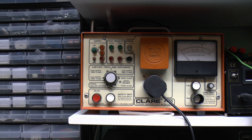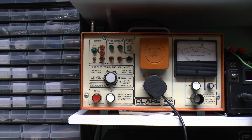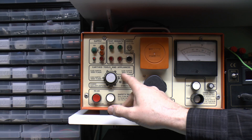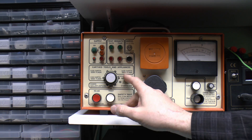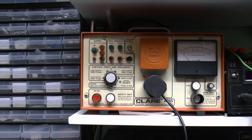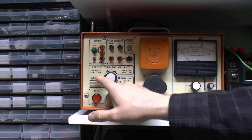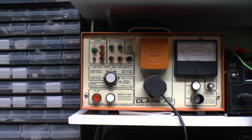This is not the sort of thing you want to do on equipment on a regular basis, because shoving 25 amps through fairly thin wires can cause them to get rather hot, and if left on for a long time you could actually end up damaging things. Note that we've got the 500 volt option, which is for normal regular testing - basically about double the RMS mains voltage. This machine also has 1250 volts, which we're going to use in this case because this is a new item. Some faults may not show at 500 volts but they definitely will at 1250.